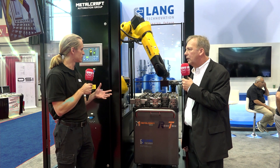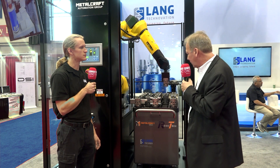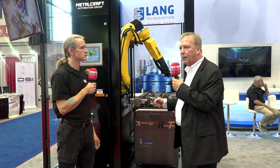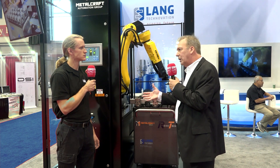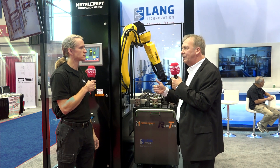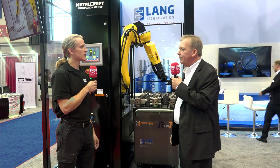One thing that's unique about this cell, at least at first glance, is that it's on a cart. So how does that locate? That cart is actually a very simple system — the cart can be pulled out, and normally this is a two-cart configuration. For the show, we only went with a simple one-cart system. You can pull the carts in and out, and while you're working with one cart, you can roll in the second one or change out the parts. The robot does identification that the new cart has been loaded in, and also locates all the tooling using the infrared sensor. Once it figures that out, it puts it into production and carries on. When the first cart is finished, that cart can be pulled out while the other one continues.